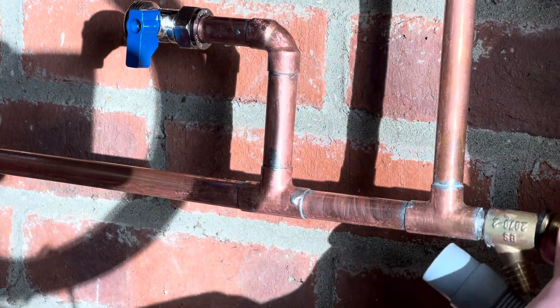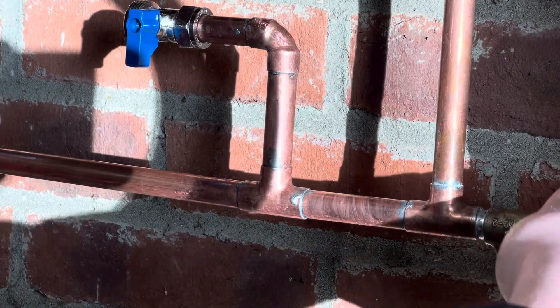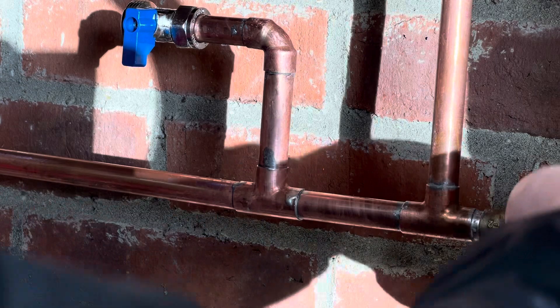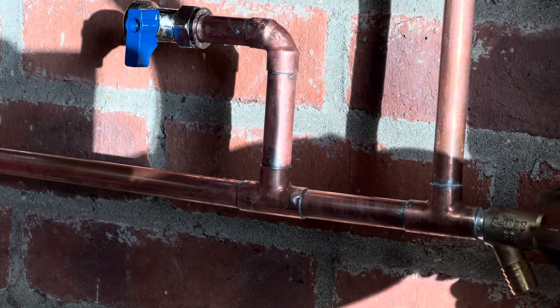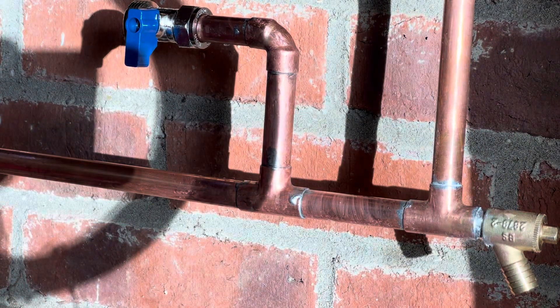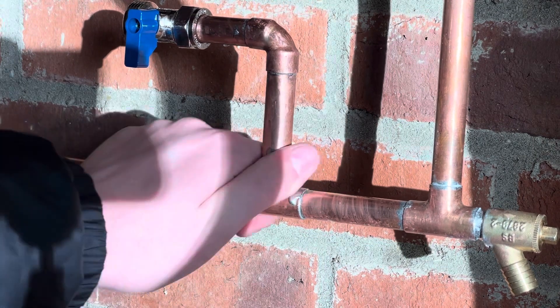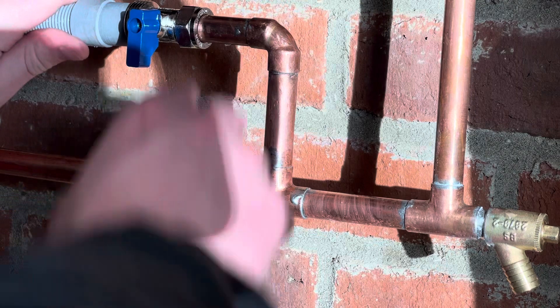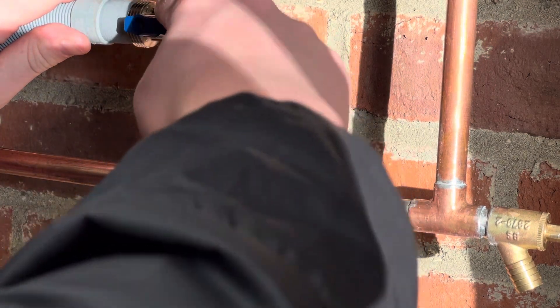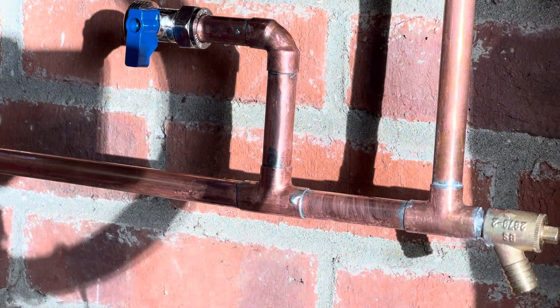What to do with the handle - I can't remember which way it was going on. Yeah, that's it. Just tighten that up. Yeah, that's good. We can now put this back in. I'm going to turn that off because we don't want water going up to that tap right now. You can test for leaks first. I hate it if there are any leaks - I don't usually get leaks. I've had a leak before, everyone has, so you want to learn from it. There we go - first time. Looking all good. That took that fine. Nothing wrong with that.